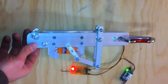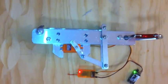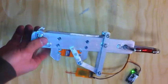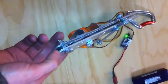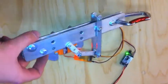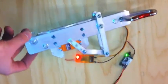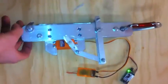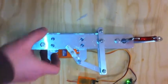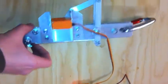It's over-engineered, as with most of the stuff I do. It only has to hold about 25 pounds on the bungee when it's under full tension for the launch, but it's all heavy gauge. That's all 1/8" aluminum plate, and then I made the actual hook out of 1/8" steel just because I figured it was going to be under more stress. So it could probably hold well over 100 pounds without any problem, but I wanted to design in a certain margin of error and safety for it as well.